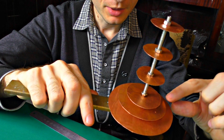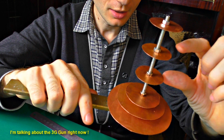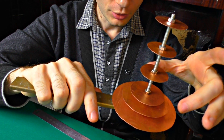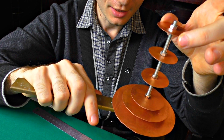The distance between the first and second discs is 10mm, second and third is 9mm, and it's 33mm between all the rest. The disc sizes are: the biggest one is 100mm edge to edge, the second is 74mm, the third is 54mm, then 39mm, 39mm, and 39mm.